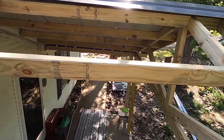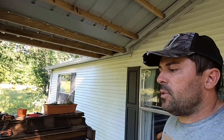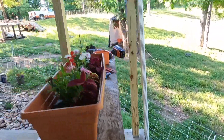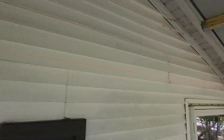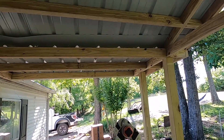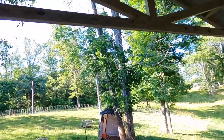All I lack is two long pieces and the drip edge. I've got the gutter downspout done over here — it just goes down to the ground. I'll suggest to the customer that they get a rain barrel. I put some expanding foam in there as well as on the other side to stop any driving rain from coming in, since that roof is nearly flat with just a very slight pitch — this way no driving rain will come into the porch and it'll stay nice and dry.